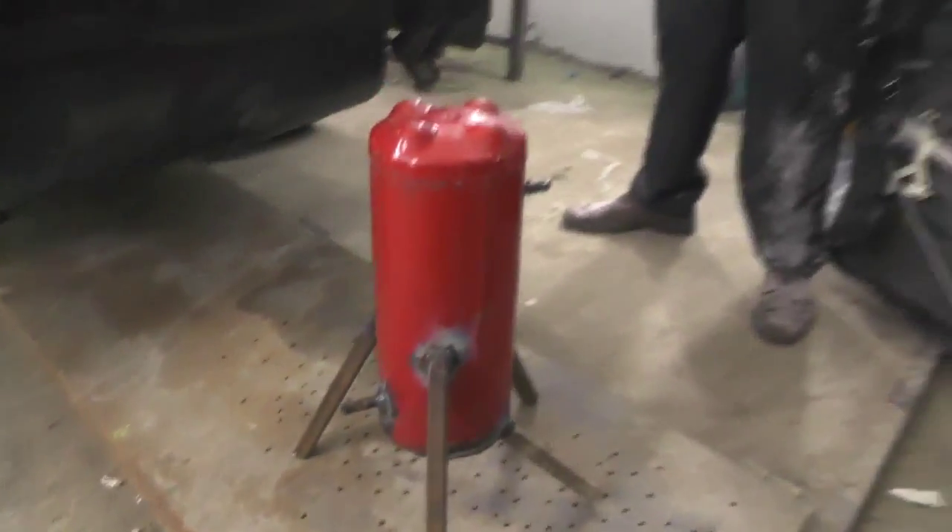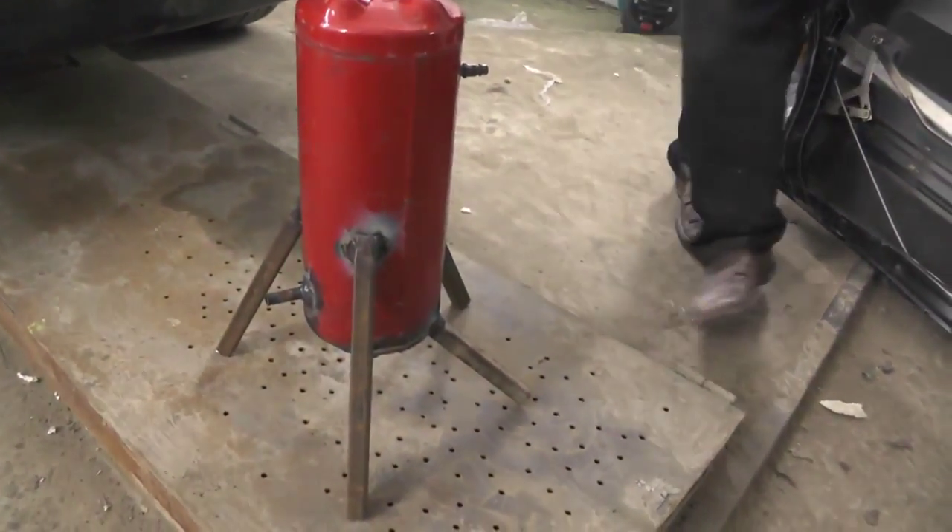An apparatus like this can be built in about half an hour without strengthening your muscles too much, and it will be better than some other super-duper expensive ones. The whole idea is to cool the air inside this thing — not to the extent of total water separation. You can definitely use your old fire extinguisher which has been lying around your garage. The walls are thin, so the heat exchange will be greater and better. There is nothing inside — do not paint it inside, the paint will start coming off later. Just wash it more frequently and it will not rust so much this way.